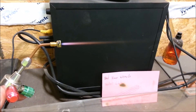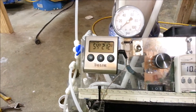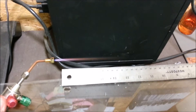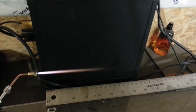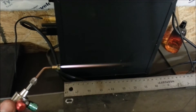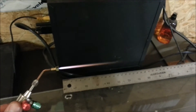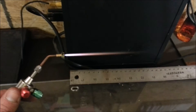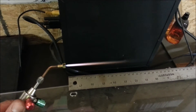This here is a gas stove spud that I just attached to my number 6 tip. As soon as the amperage goes up it'll get a lot bigger — I'm only at 10 amps right now because it's so cold, I'm at 54 degrees. Still doesn't seem to shrink any, but it will, and that's when we'll be at the turbo flame. I don't know what to call this flame — I've been looking all over in open literature to find out if it's called the turbulent flame. I'm not talking about reducing flame, oxidizing flame — this is a whole different flame.